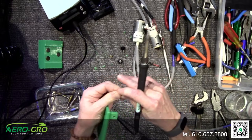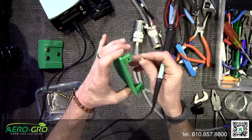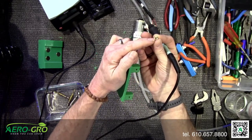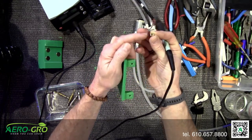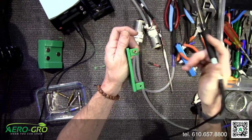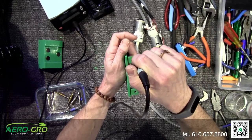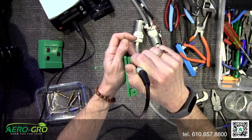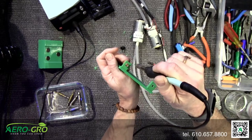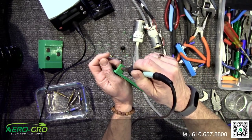That was way overcomplicated. It's just hard because it's on camera. You're trying to describe something that you do with your hands, you know? Okay, so the flat, shiny, non-knurled part goes down first, right on top of the hole. Then you take your soldering iron and place it into the knurled part, not touching the plastic, just touching the knurled part. Let it heat up, and as it heats, you'll be able to push it down into the hole.